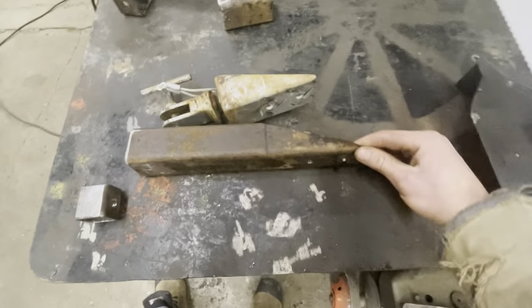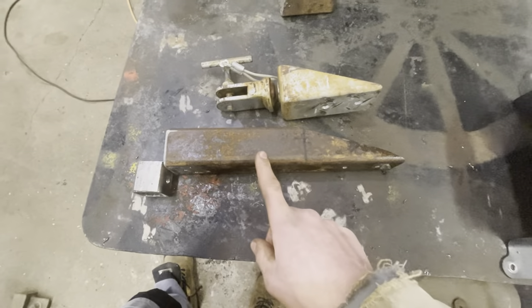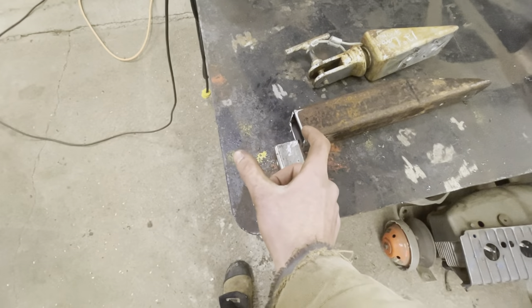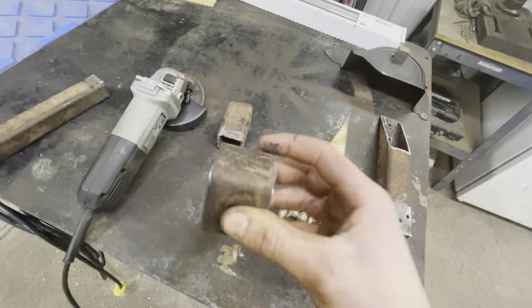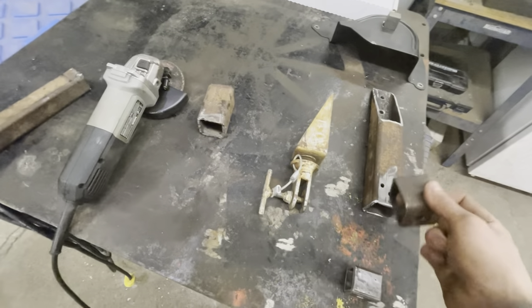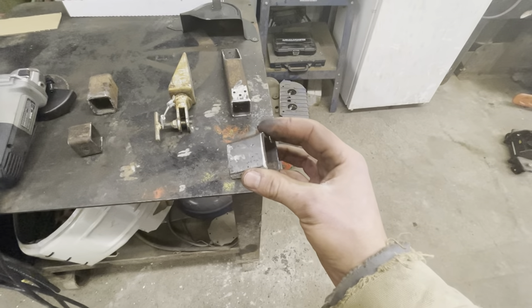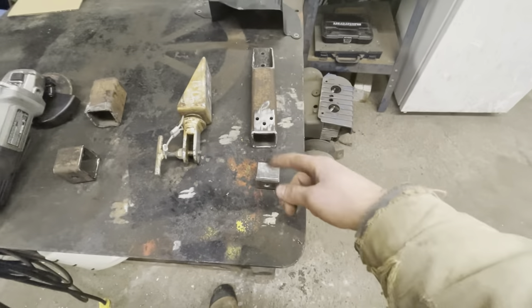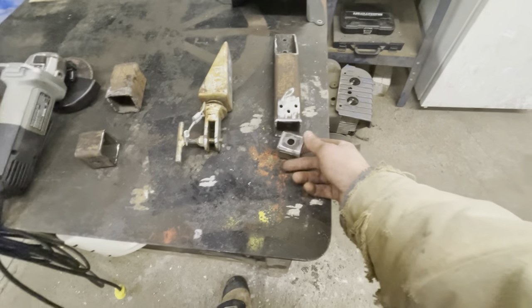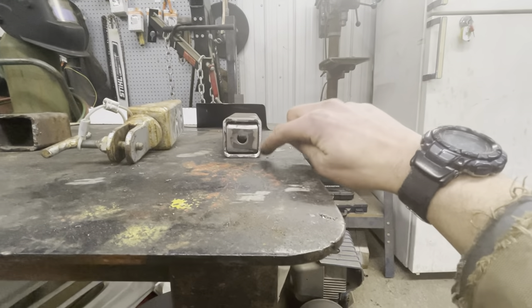I shared that bolt pattern there to bolt it back on, but I wanted it 12 inches longer. This piece isn't quite 12 inches longer, but the spring hitch is going to be a little bit longer, so I wasted a bunch of time making this. That's a half-inch hole for the spring hitch to go in, and I was going to get it in there like that, but it was a whole lot of extra work. Then I remembered I had inch-and-a-half tubing from a project years ago that fits inside, so I had those as mating tubes for adjustability on different projects. Now I've made this with my half-inch hole in there, so we're going to weld all the way around.